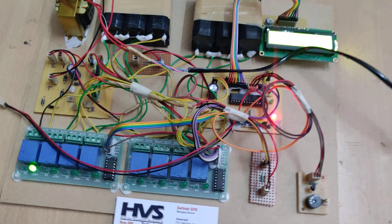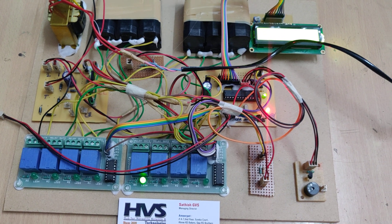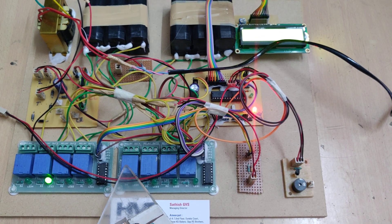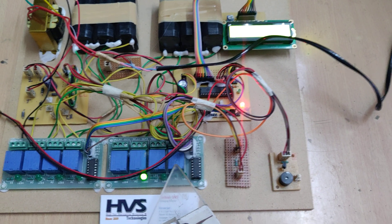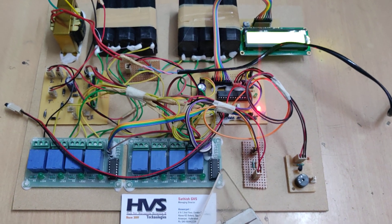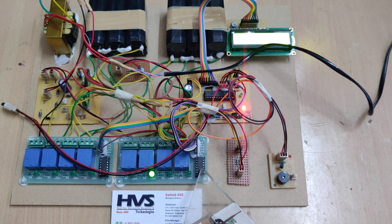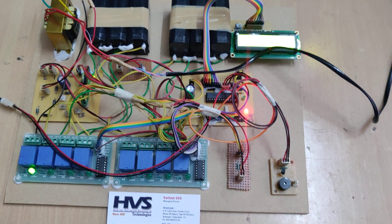The system is switching between the relays for each and every battery pack. One relay measures the total voltage while charging; the others measure cell 1, cell 1 plus cell 2, and cell 1 plus cell 2 plus cell 3. The relay board uses a ULN2803 driver. The microcontroller triggers the ULN2803, which switches each relay based on the input from the microcontroller.